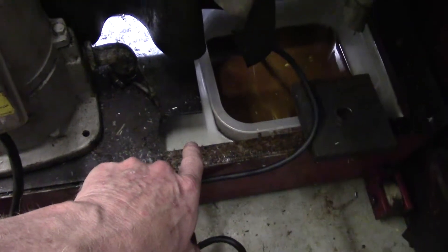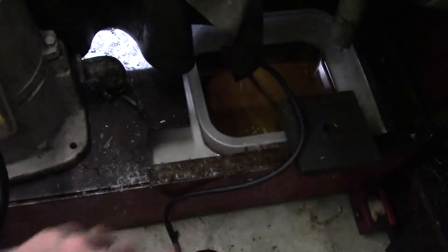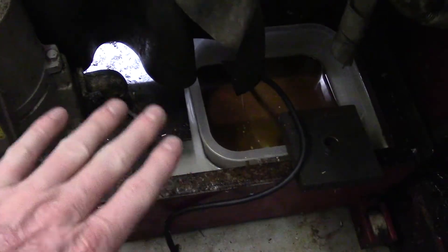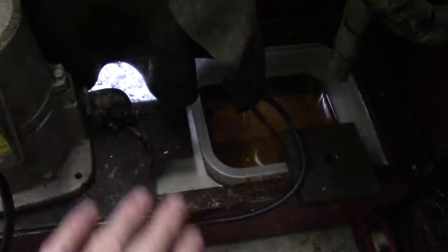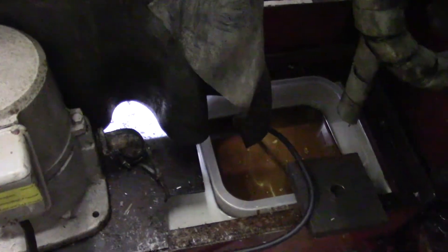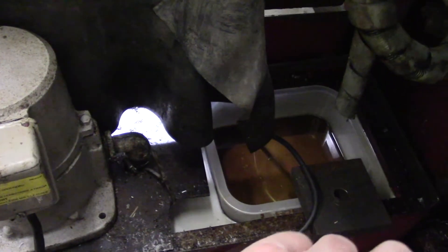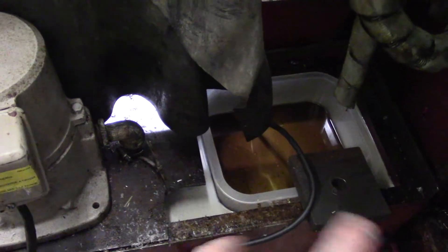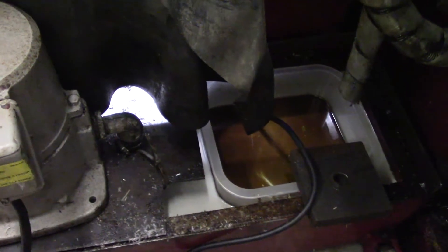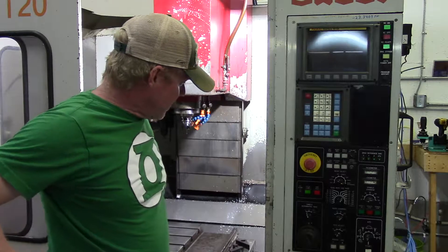The coolant load looks pretty close to new still, and this just runs all the time. Occasionally I'll put down an absorbent mat to catch areas not making it back to the tank, but in general this covers both tanks. The only issue is if you wait several days, the other tank won't get enough flow. So if I know the machine is going to be down for a while, I try to come down and turn the pump on just to get some circulation going.